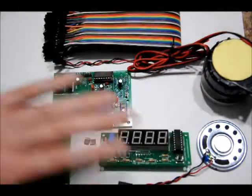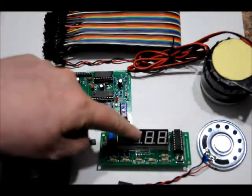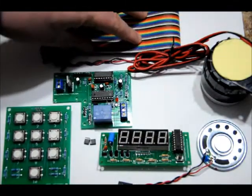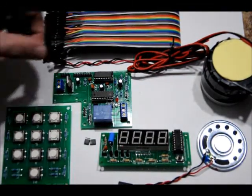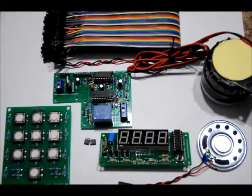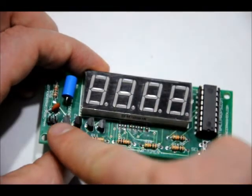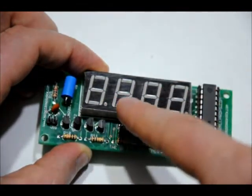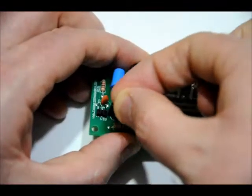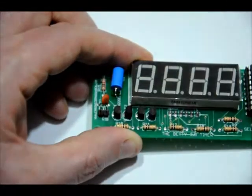This is what comes with the Betty 3.2. It will come with everything connected unless packing becomes an issue. Components: main processor board, timer board, keypad, two-pin jumpers, speaker, loud siren, and connector wire. You'll get extra connector wire — for the wire-cut area, you can either snip or pull; I suggest pulling because you can easily reconnect and save the wire. To enable the vibration circuit where the timer decrements ten times as fast, short the two pins with a two-pin connector. If it's a function you don't want, simply remove it and save the jumper.